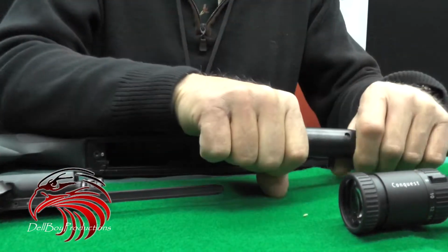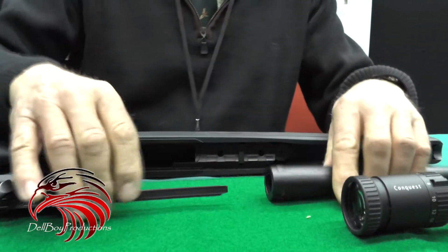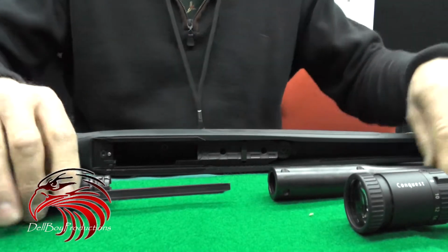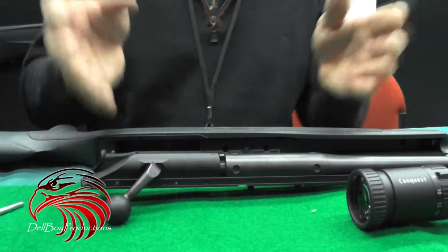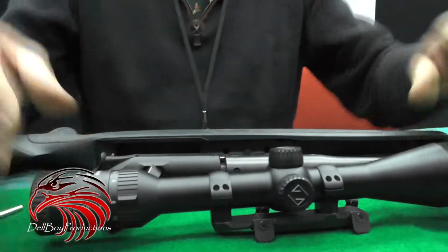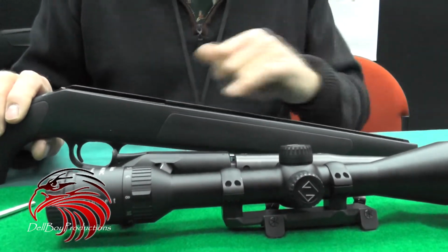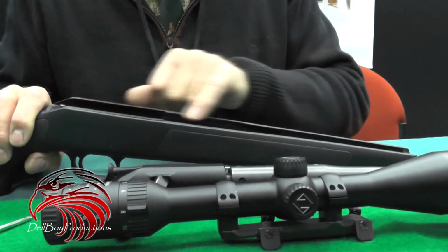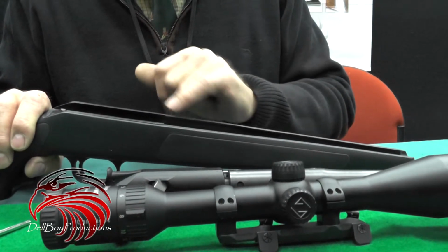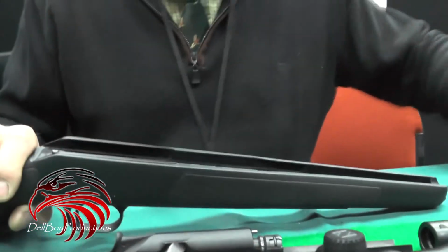Yep. There's one weak link. As soon as you thread, you've got a weak link. Okay, they've removed that weak link, so you have no receivers. A receiverless gun. Okay, and the heart of the gun that gives it the accuracy is the barrel. So we do everything on the barrel, and to make the barrel independent of the stock, to make it completely free floating, they have this alloy extension which has 8 little pads sitting on here, which the barrel is pulled down onto with 2 screws.